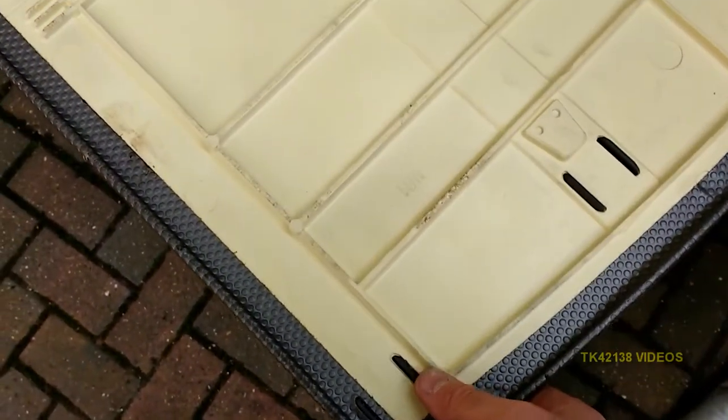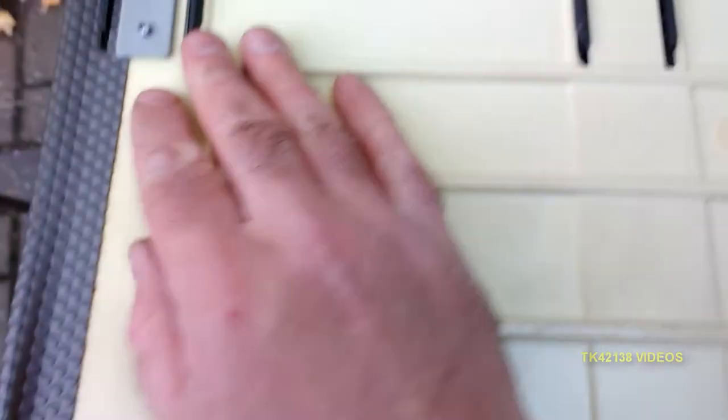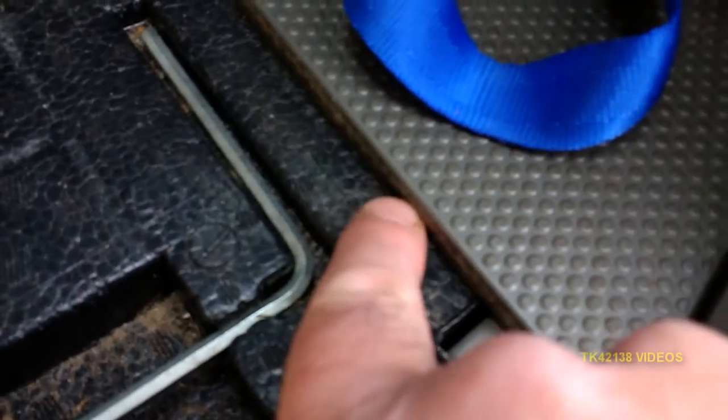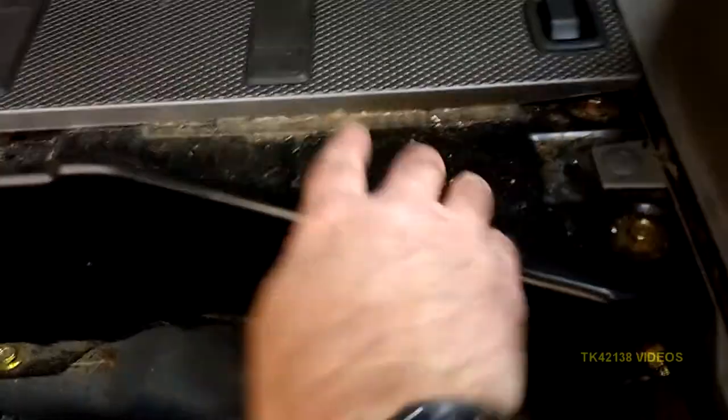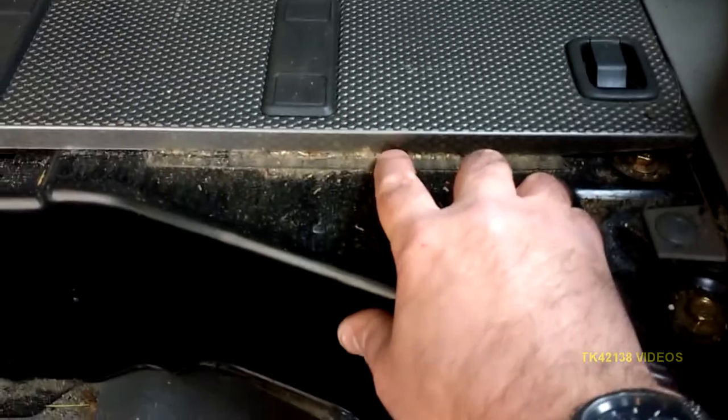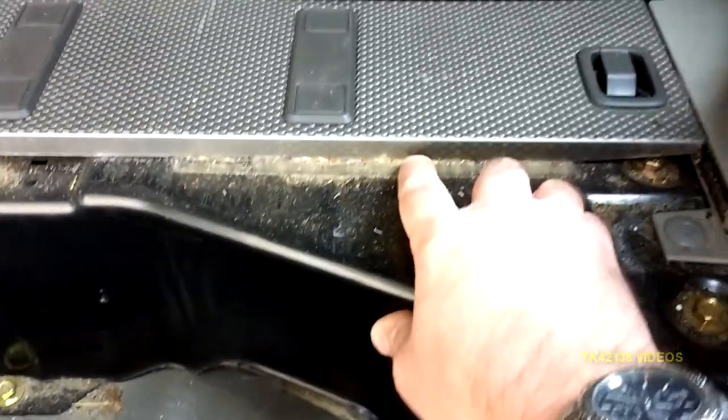The problem with this is it's plastic, and it flexes if you put too much load on it. These ridges here are strengtheners — ribs — but they're not very deep in cross-section, so that's why it will flex. There's not much room for adding extra strengthening ribs because you've got these inserts, plus the thickness of the removable floor panel. It can't be any higher than this, otherwise it will catch when you're loading stuff. And if it's thinner, it might be even more flexible.